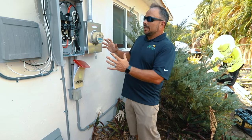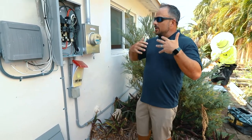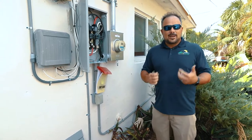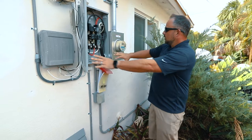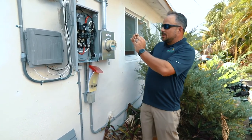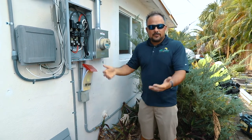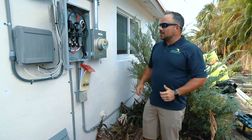What we've done is taken what used to be a combo panel and thrown that away, had FPL shut off the power, and installed a brand new load center. This way, if Mr. Harris or his family wants to add anything down the road, he's not maxed out. We have a brand new 200 amp service right here, in addition to a brand new meter can. We're going to make our connections on the hot conductors between his main breaker and his meter so that all the solar that feeds in won't hurt any of his other appliances.